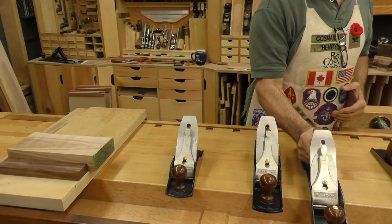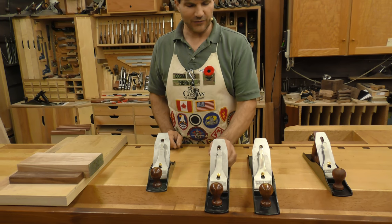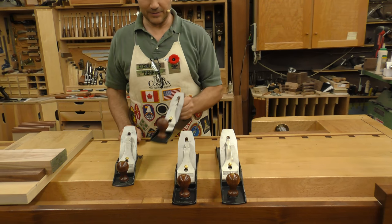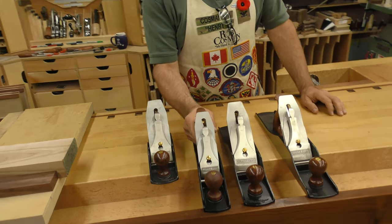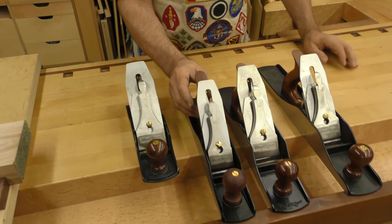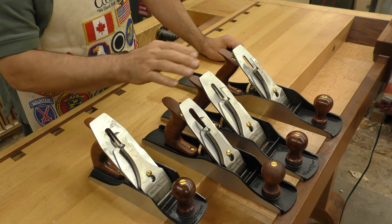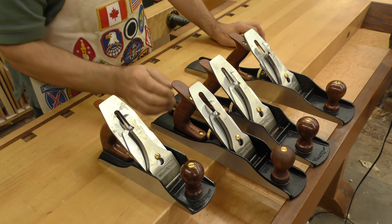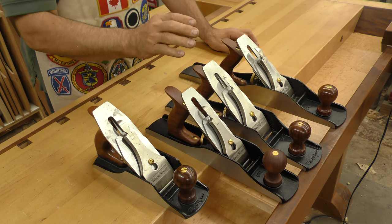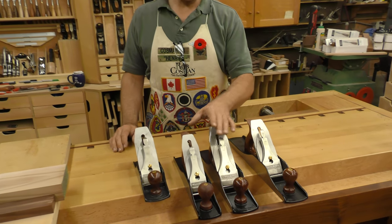For some it could be a little bit too big for general purpose on the bench, but I could use either one. The five and a half is still my preference. Now where does the five fit in? It's a little bit shorter than the five and a half and it's a narrower plane — only two inches wide. The wider the sole, the more stable it's going to be in use. I consider the five and a half to be the grown-up version of the five; it's a little cramped, you get a little more room on the five and a half.